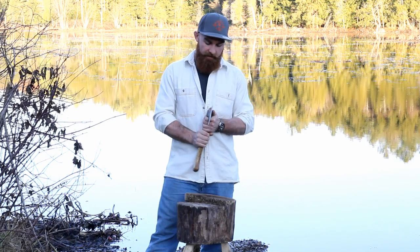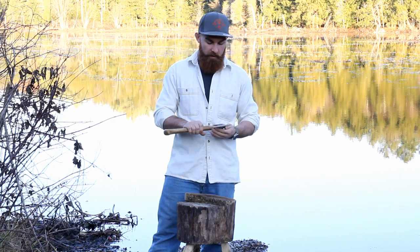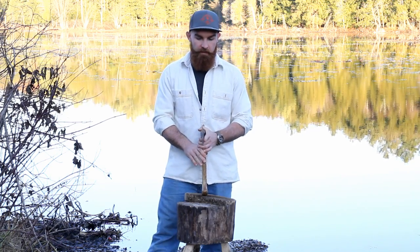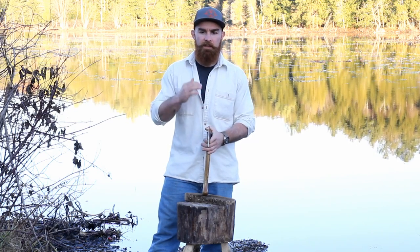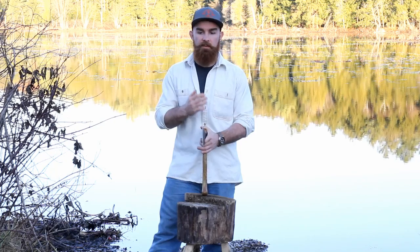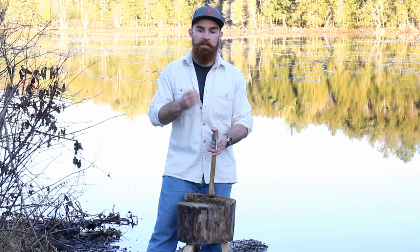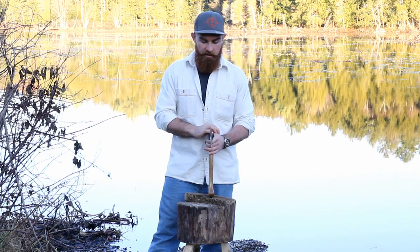This axe inspired this model here. What was very important for me in making this axe was a quite long cutting blade, but not overly long because it might just get in the way with a lot of carving procedures. Very important as well is that the cutting edge is able to slice, so it has to have a certain length — but at the same time, when the cutting edge becomes too long, it spreads the weight of the axe too much and you don't get that crisp feeling in stock removal.